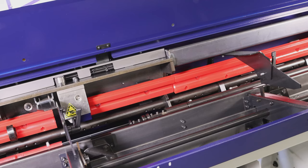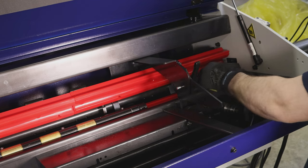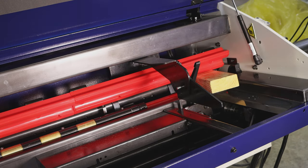Whenever air is applied to the machine, the support shaft and top guide channel assembly is engaged and will prevent us from being able to manually open the guide channel. For safety precaution, we will take a 2x4 and place it in between the top and bottom guide channel supports towards the nose end.